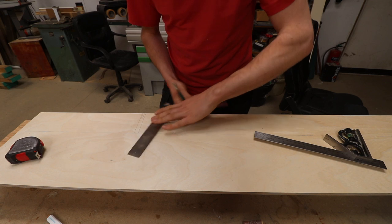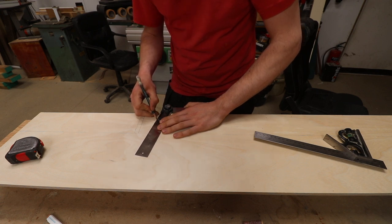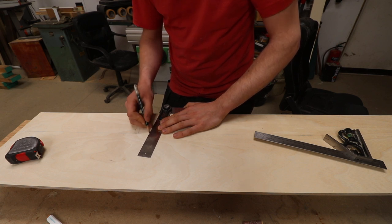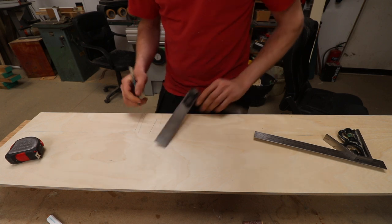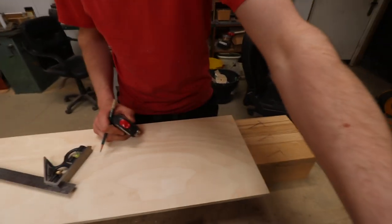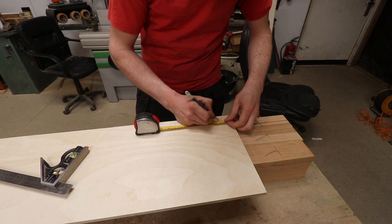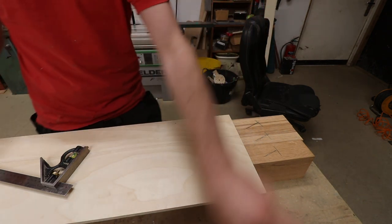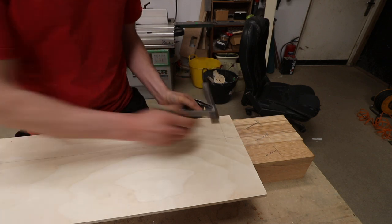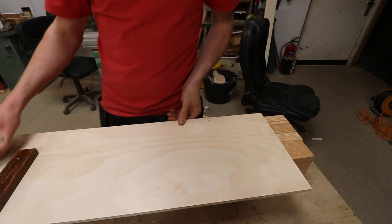With accuracy of the drawing, I'll add on a bevel there to suit, 9mm bevel. 99, somewhere there. So that's our sill section. Draw the head on as well. So again, 58mm section size, 43mm to the rebate. Draw them in lightly. Mark our rebate on 65. And that's our timber section.